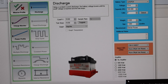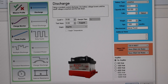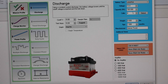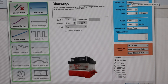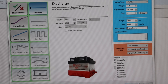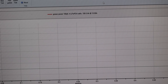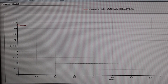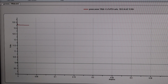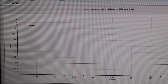We've got everything set up here. We've got the 100 amp hour battery and we're going to do the drawdown at 10 amps, because that's all I can do with this one. Everything's set up — it detects the four cells and it's reading at 13.4 volts right now, which is pretty standard for these 100 amp hour lithium iron phosphates. We'll be back in 10 or 11 hours when this is done.